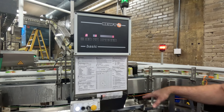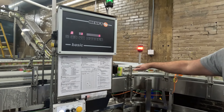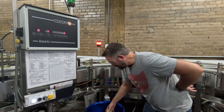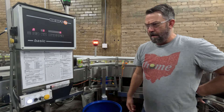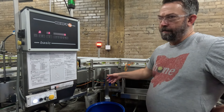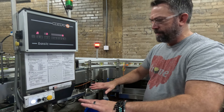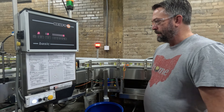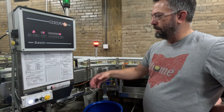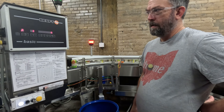It's using an x-ray to look through the can. If it sees liquid, it says the can is filled appropriately. If it doesn't, it'll dump the can to reject it off the line. Particularly at the front end of a run, you'll get a few rejections, and then staff can come over and check the machine by weighing the can on a scale to verify. I have not seen this before — it's an x-ray actually checking liquid level.